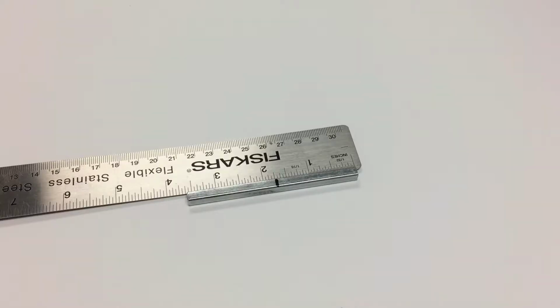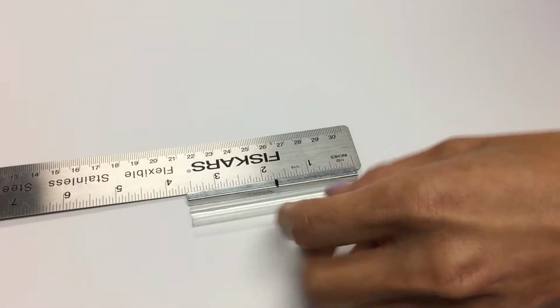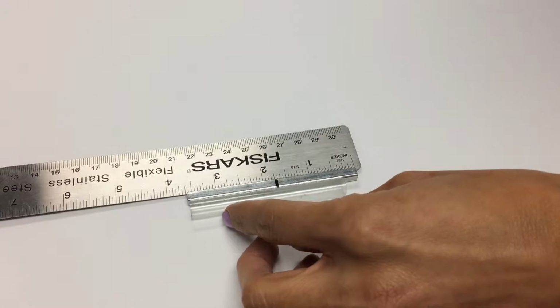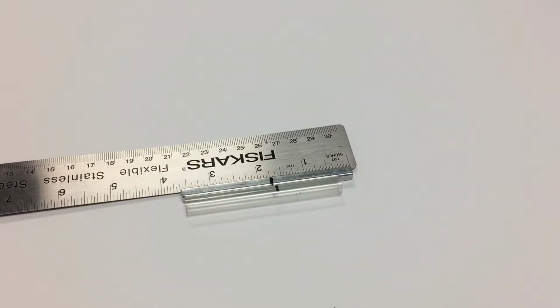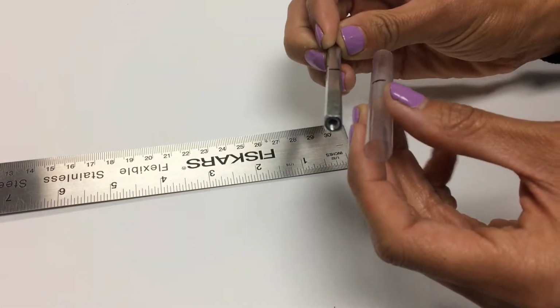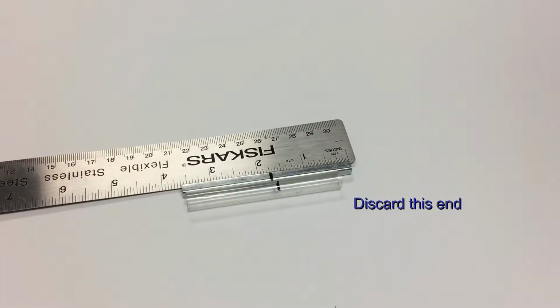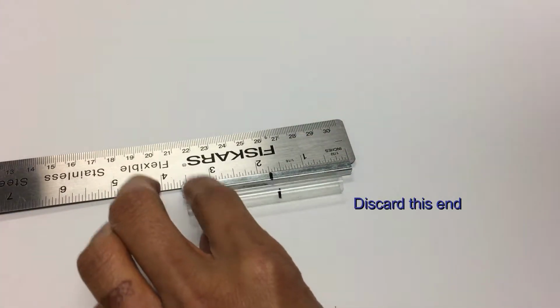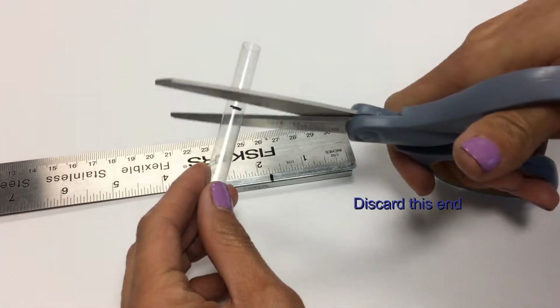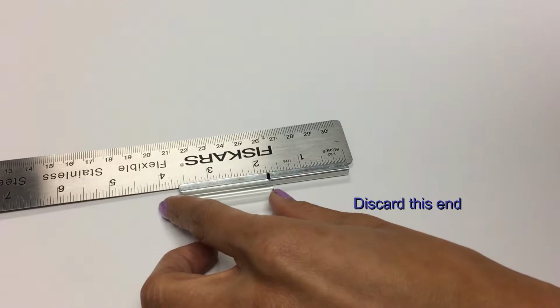With the spindle cut for the correct length, we now need to cut the protective tube that's also found in your package. So lay the protective tube beside the pre-marked spindle. You want to mark the protective tube at this mark from the drilled and tapped end. Now go ahead and cut the tube at that mark. Perfect. We're ready to do our installation.